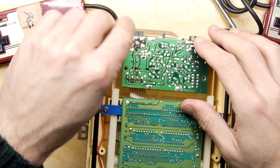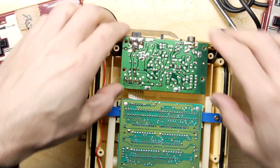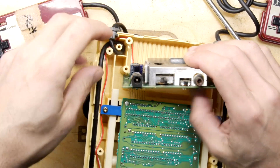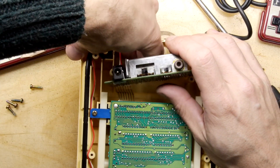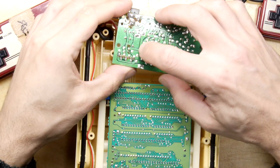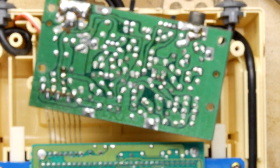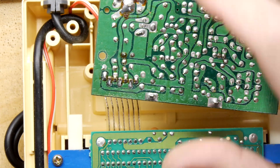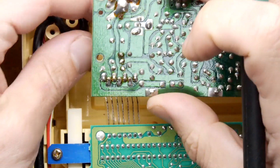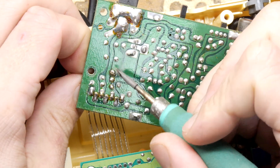Before I desolder this one, I'm just going to flip it over so you get a good look at how it's connected. I'm going to probably just be doing the desoldering on the top. You can bend it over. Be careful, there is a power wire there — that red one. If you want a bit more freedom, just pop it up there. And that power wire goes to these two tabs here. So we're going to be unsoldering a couple of those. Now, some of you will have a solder sucker and some of you won't. So I think I'm going to attempt maybe to remove some of it without a solder sucker, which is the least preferred way, and then some with.